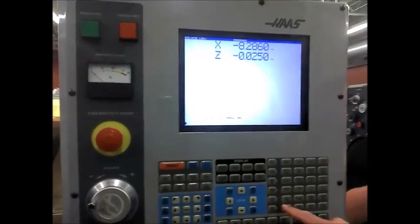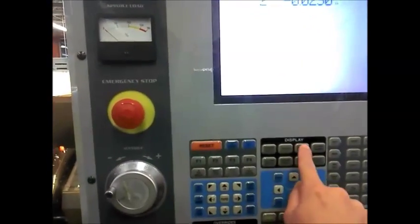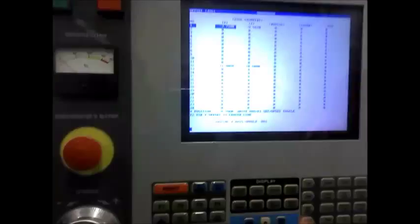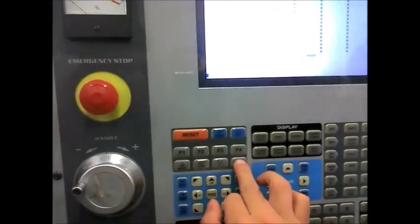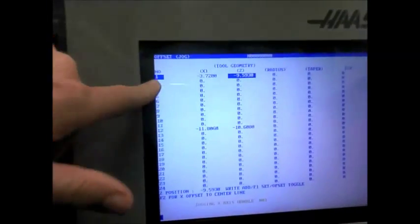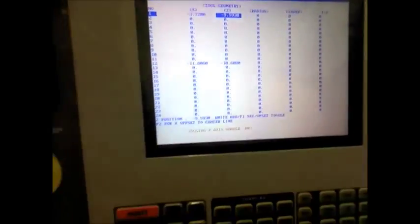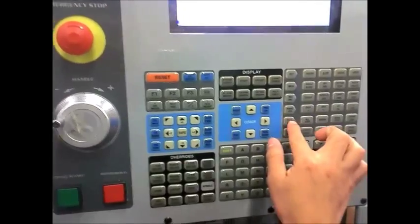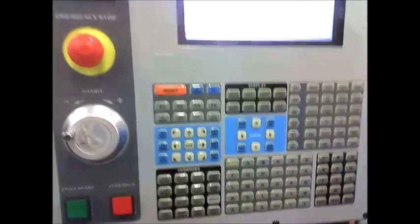You can go in and — no, don't send it home. I'm sorry, no. I have to set my — go to offset. Offset. And go there. And you hit Z face measure. We're doing tool number one, so it's going to automatically show up as tool number one. And now you can send it home. Zero return, all axes. Now you help the next person.